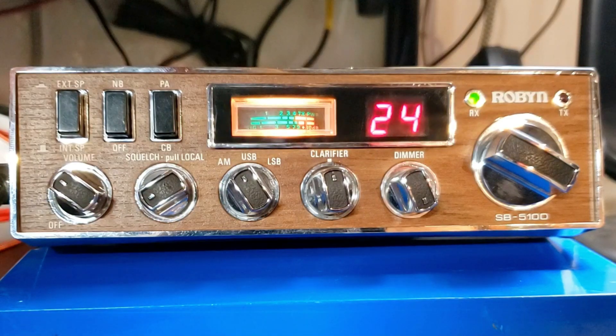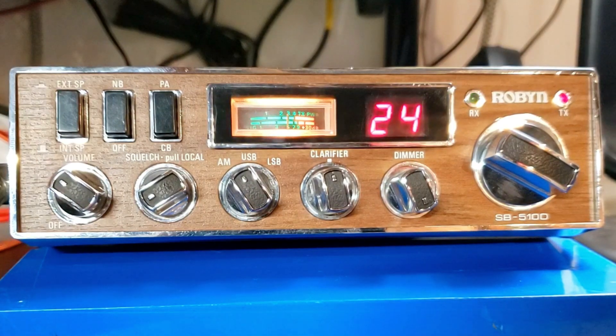It could be both — there could be a dial adjustment on the inside, an RF gain adjustment. So check the schematic and readjust that, or just check that switch out — put a volt-ohm meter on the switch and check it. You've got capability for sideband? Want to go upper — or we can do both if you've got the capability for upper and lower. Yeah, I've got everything on this rig — AM, FM, sideband, everything. Let's go upper sideband.